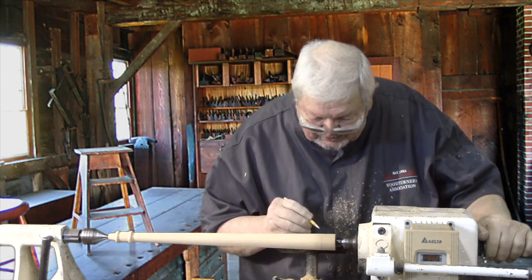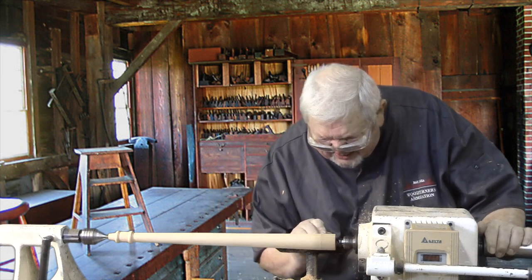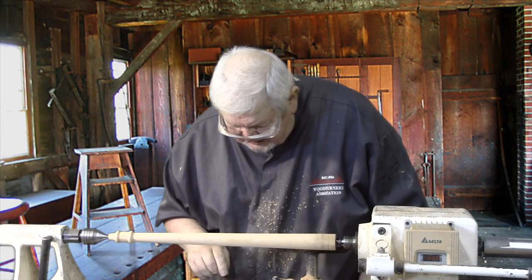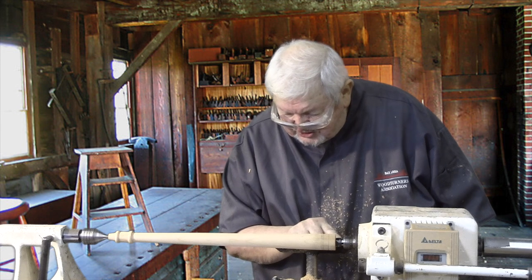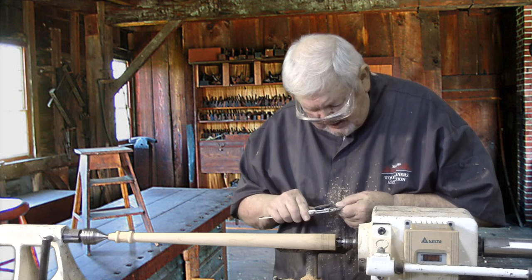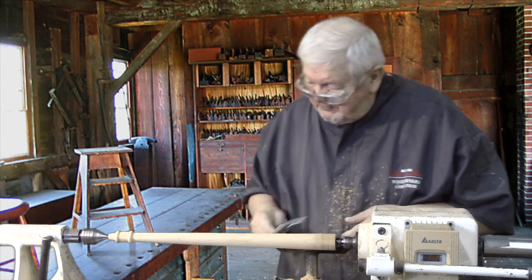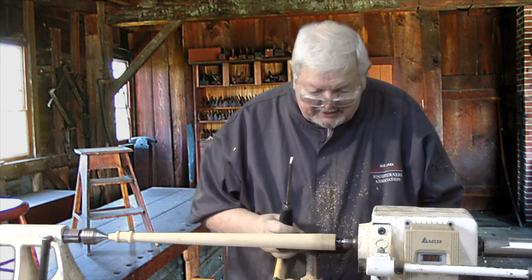I'm not going to transfer the things around that way, but I did put a little pin mark with the jaws of my caliper, which I now can transfer around. That's the cove. That's the fillet. And there'll be a fillet on both sides of that, and then this just rounds off to a bead. And that should be about 1.5 here. Yeah, that's fine. Okay, so let's put the fillets in first. That's a parting cut.